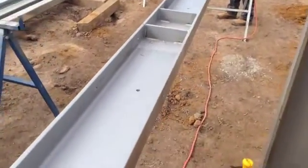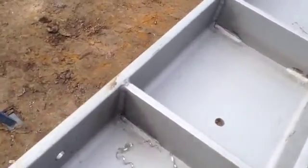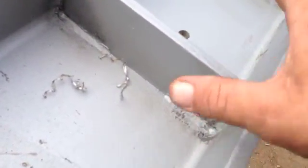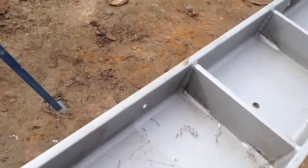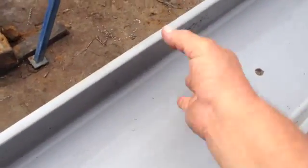I thought we'd show you what's happening with the portal frame. These get welded in — you can see there, this one's welded all the way around. It doesn't have to be completely welded, as long as it's got the welds to hold. The idea is to stop the C-channel from crushing, so it's only got steel on one side, top and bottom.